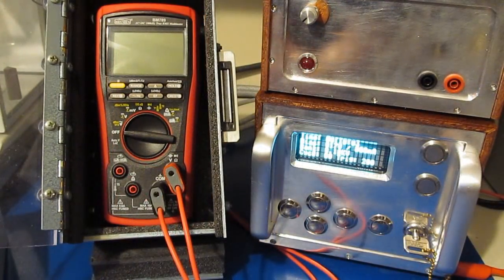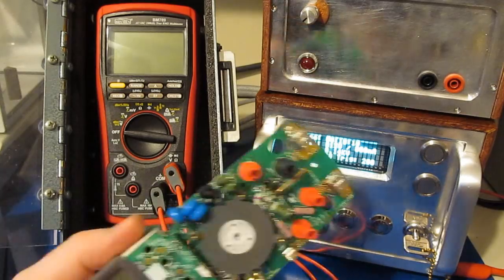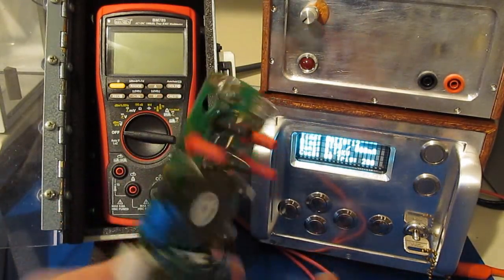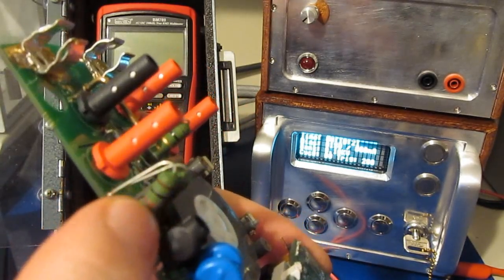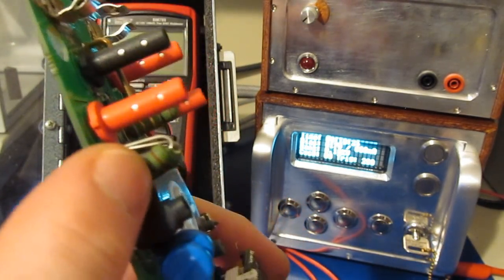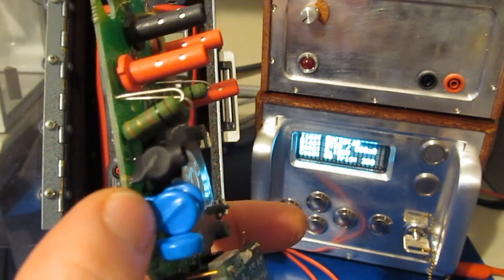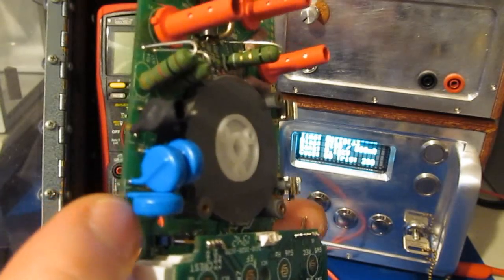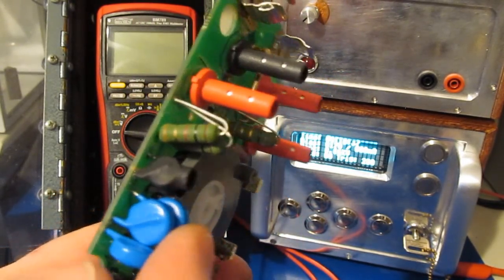I've had people tell me that I run these tests so fast and I'm not giving the MOVs a chance to cool down, and we're stressing the MOVs, and boy, it's all about the MOVs. If you look at a meter, you have this surge-rated resistor that's going to be in series with the PTC. This is a 1K. It's typically about 1.3K. And then we go to the MOV, which is normally in series with another MOV, getting us up a little bit over 1,000 volts.